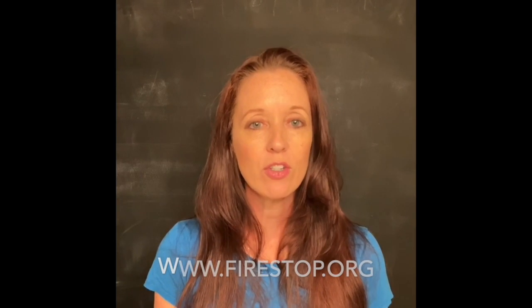If you want more information on that, please go to the International Firestop Council's website. They have the guidelines for accepting engineering judgments. Also know that different jurisdictions have different requirements as well. If you're working in a new jurisdiction, just a thought, but I would recommend that you reach out to the building department and ask them how they handle engineering judgments. If you're in Mecklenburg County, North Carolina, or Clark County, Nevada, you won't be able to use the engineering judgments the same way that you use a standard UL detail.